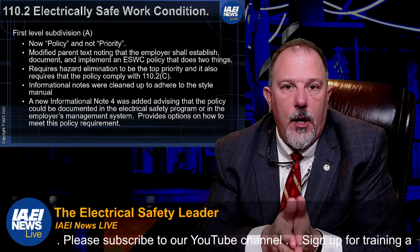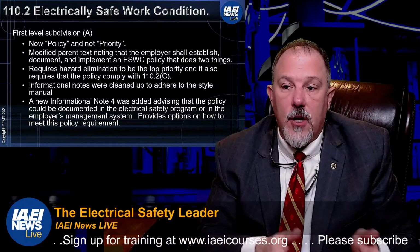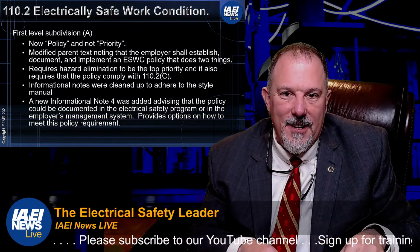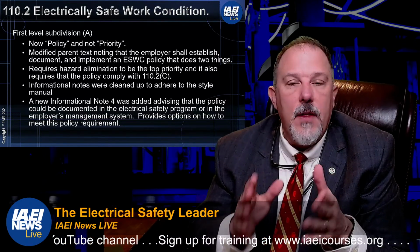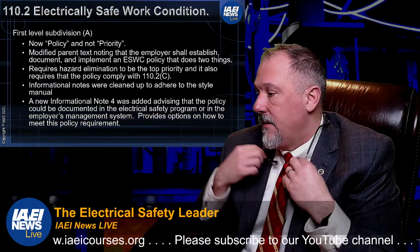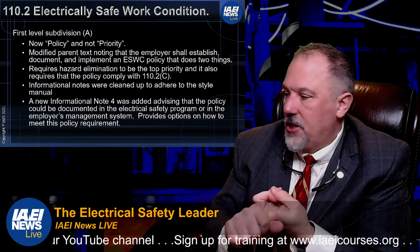And what comes with that? What comes with the exception. So if you're going to do energized work, it has to be justified. You have to go through the process that is required in 110.2 to meet the exception of not establishing an electrically safe work condition. Hopefully you can see the importance and emphasis that they're placing on that. Now, does it change what we do? No. Outside of creating a policy, because it says that the employer has to establish, document, and implement an electrically safe work condition policy that basically requires hazard elimination to be the first priority.